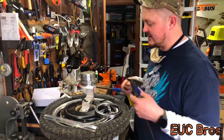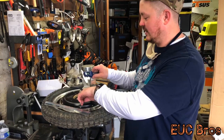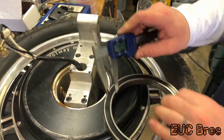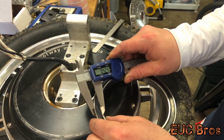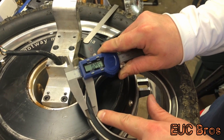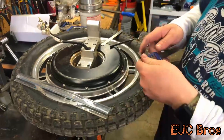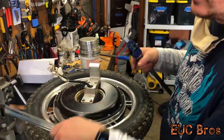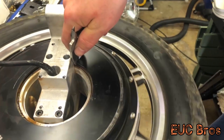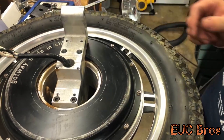The way we're going to accomplish this is first we're going to mark where we want the holes. We're going to lay them out, and from the edge of the inner cover here, we're going to measure how far away from the inner cover we want that. The inner cover lands just inside of the inner race, and we want the hole to break out just right about where the seal is. So we'll say about 330 thousandths from the edge. Take your calipers, lock them, hold them onto here so that they'll scribe, then rotate your motor and scribe your circle on the radius — on the diameter — where you want to actually drill.